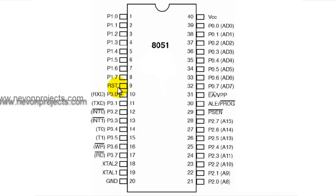When an interrupt is generated, the 8051 halts whatever it is doing and services the interrupt. So if we want an external event to be recorded and a reaction given to it, we can do so by sending a low pulse on the INT0 pin and executing our ISR — interrupt service routine. After that, the 8051 goes back to its normal functioning. The same is true for the INT1 interrupt.